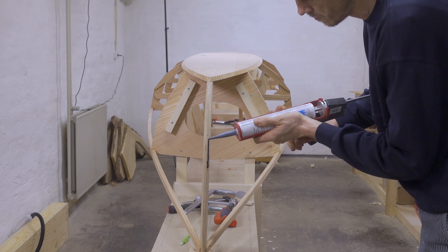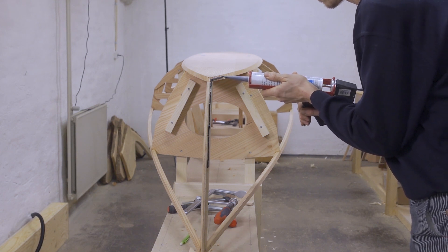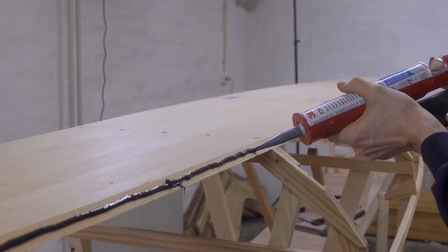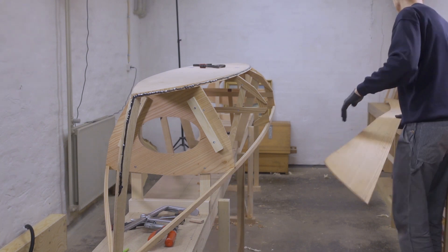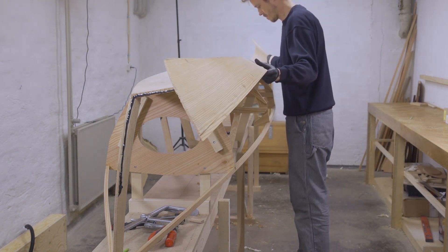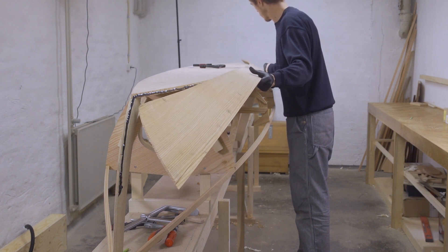Now the plank is ready to be installed on the boat. I'm running a bead of slow-curing polyurethane caulk along the entire joint from stem to stem. I'm using 3M 5200 which is very slow curing — this gives me plenty of time to get the plank into place even if something unexpected happens. The 5200 is both a sealant and a glue, so it helps keep the boat watertight and also strengthens the joint between the bottom and the garboard. One bad thing about it is that it's extremely messy — it gets everywhere in no time. When uncured it can be removed reasonably well with acetone, and when cured it needs to be removed mechanically with chisels, planes, sandpaper and such. I'm wearing rubber gloves and trying to get the alignment as precise as possible before the plank comes into contact with the caulk. If you can get a helper or two to assist with the alignment it's definitely a plus.